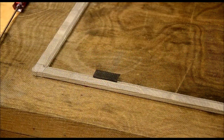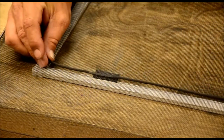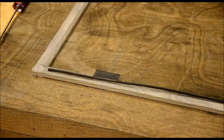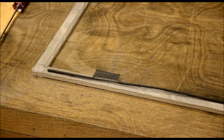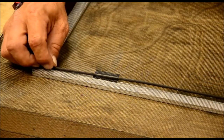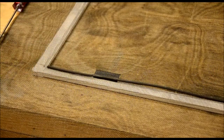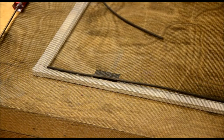We've got a close-up of this corner here. We're going to take the beading we originally removed and line it up to make sure it's the right length, so that when we put it in the frame all the corners match up to how it was when we took it out. If your screen frame is square it's less of a concern, but if it's not square you definitely want to make sure you've got the right bead measured out for the right side.